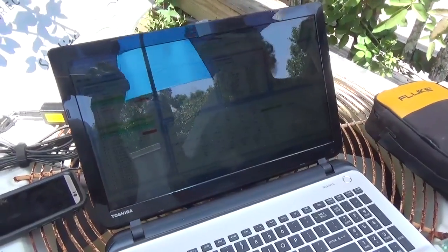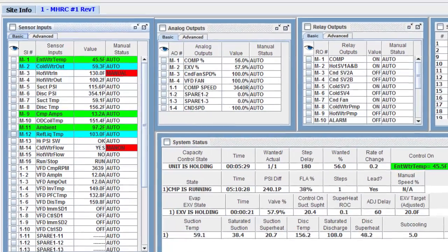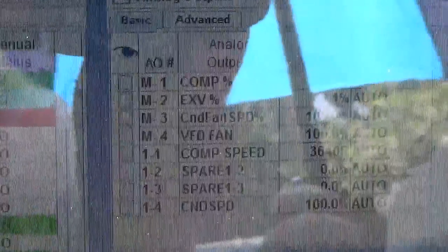I'm back running some tests on the chiller. I'll put a screenshot in, but what this is telling us is that we have 45.3-degree water going out of the chiller and pumping through my hydronic A-coil in my air handler. Running full bore, the ambient temperature outside is currently 95 degrees. The unit is only running at about 14.6 amps at 230 volts — that puts me at about 57% capacity, running at 3,640 RPMs. It can go up to a max of 5,000 RPMs. I'm using less than 15 amps to keep a 4,300-square-foot home at 74 degrees on a 95-degree day in direct sun.